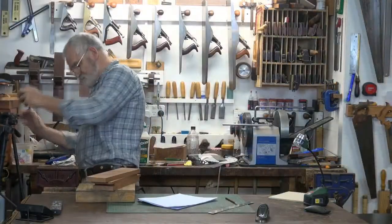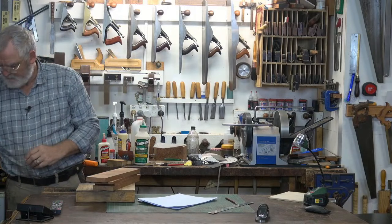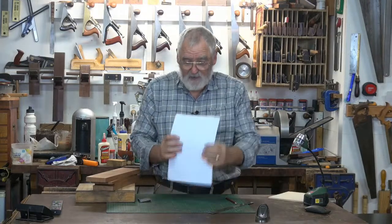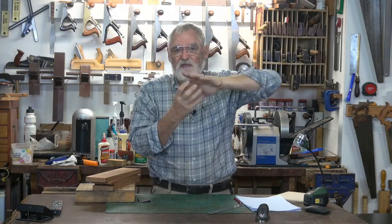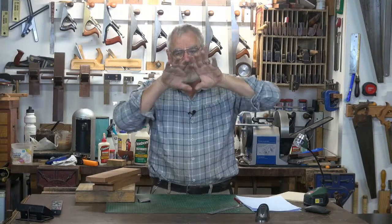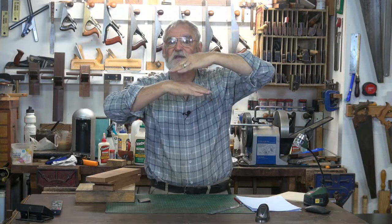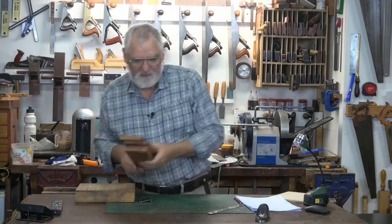So that's how they arrive at the different ratios. What they're for is this: the lower the number, the wider the dovetail, and that is used for softwood, because softwood has a lot of pith and soft grain in it, and as it shrinks and gets used, it will compress more. So you might start out with a 6-in-1, and after many years of use, it could come down to a 5.5-in-1. If you started with an 8-in-1, which is a narrower dovetail, over time that could flatten out and it wouldn't have that locking effect that the 6-in-1 does.